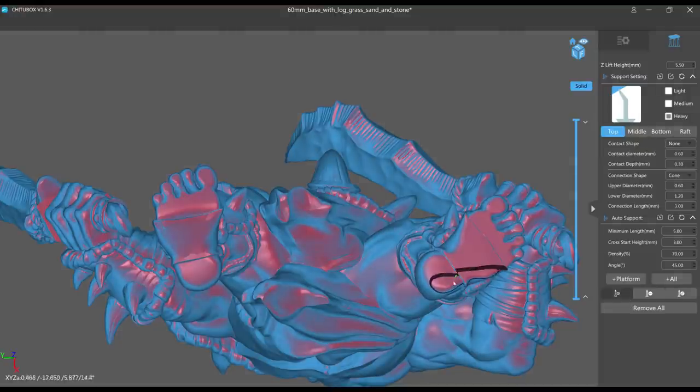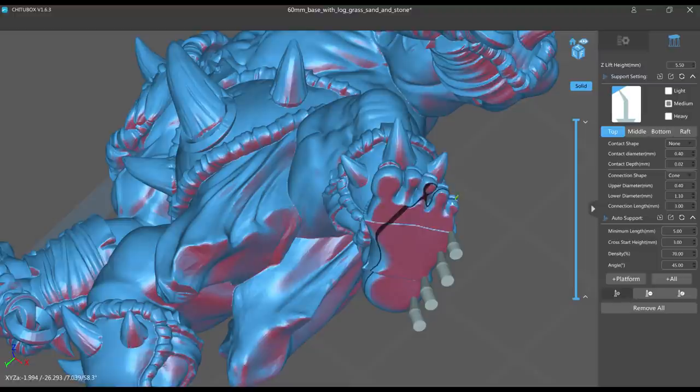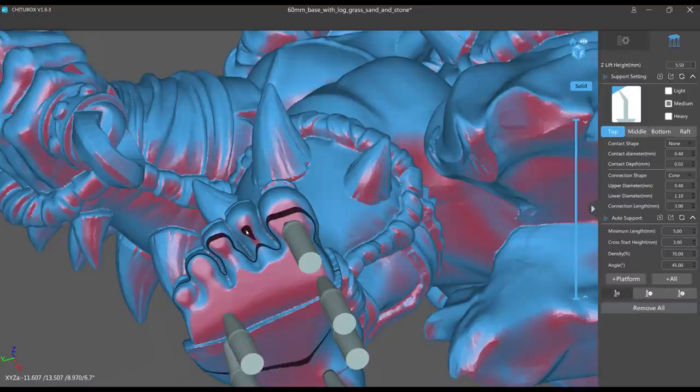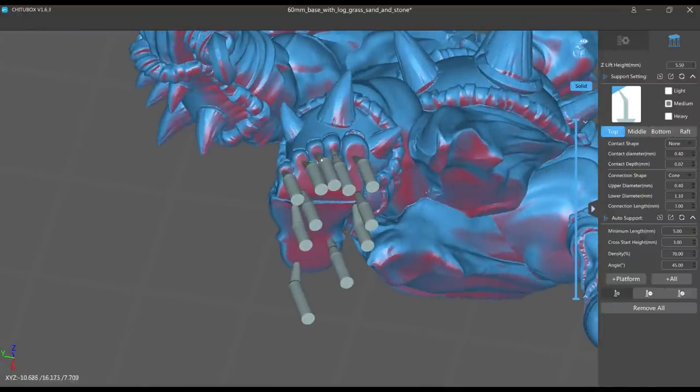I'm going with 0.60s here because I'll put a few of them — there are a couple of islands created down here. On this right foot I'm making sure I hit all the big points because it's a big heavy model. Once I've got all the main anchor points placed, I can go back in and use something smaller, like a medium, for the toes. I want to minimize damage to the outside of the model and make supports easier to remove. Each toe is its own tiny little model but it's barely supporting any material, so I don't need anything heavy there.